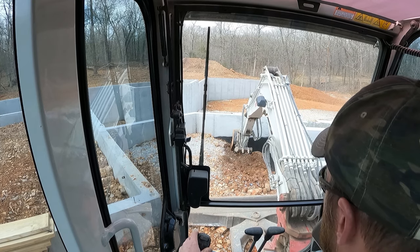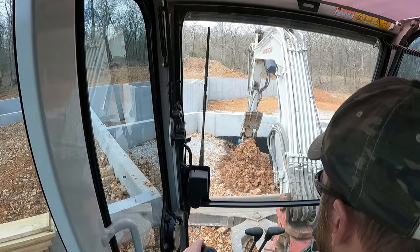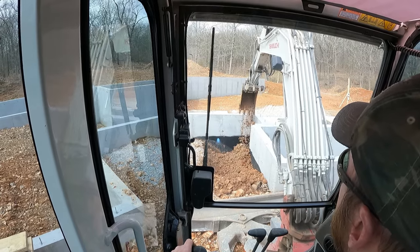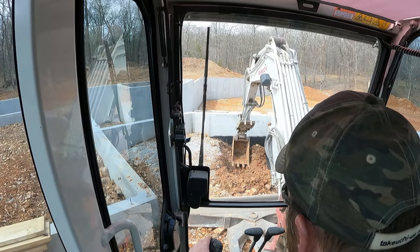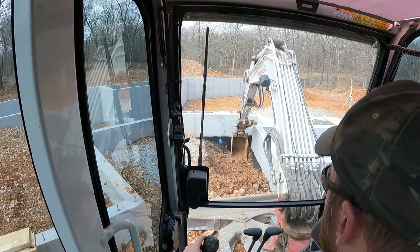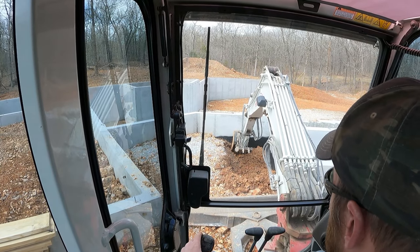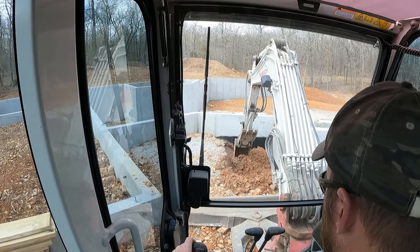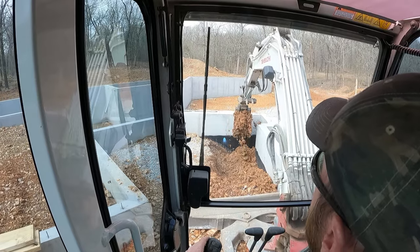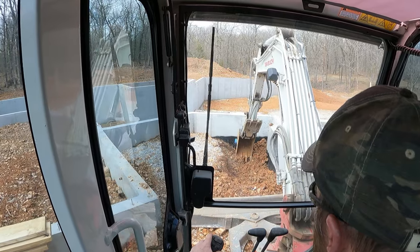That blue dot is where they want the water line to come in. Of course, it's going to be, I think I put it in like 30 or 34 inches deep. And we ended up, I kind of talked to the builder. I tried to talk him into it earlier on, but running the 2-inch line to the house, but there's a big expense. I believe right now here in Southwest Missouri, 1-inch schedule 40 PVC is, what they tell me, 62 cents a foot. And for the 2-inch is like a dollar more. So it's quite a bit more expensive.